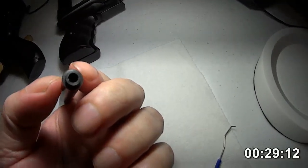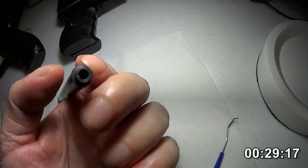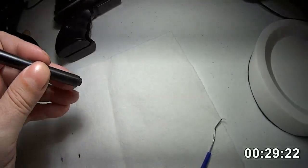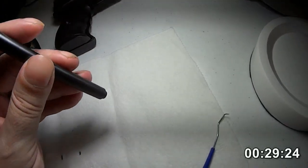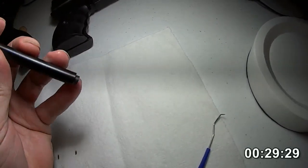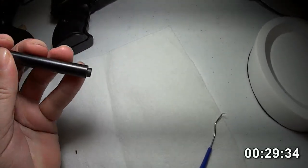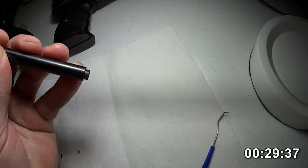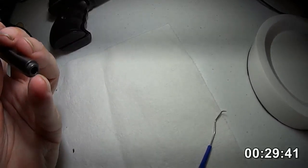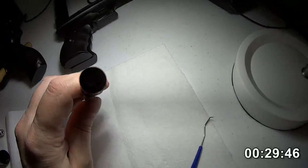I told a guy that had a Glock and a couple of other handguns. He had these steel stands for his gun where the barrel of the gun would be like this, and then you'd have a steel rod through the barrel to make the gun stand up. That's a bad idea, because you're touching that crown. Unless that thing is plastic coated, or made out of plastic or some other material, over time by putting that gun on that stand you're grinding away that crown, and then you'll eventually have to re-crown the barrel.